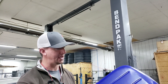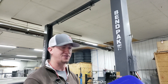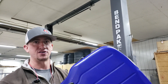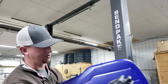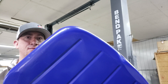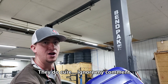This is the back of the vintage chair that we're restoring. When we put on the top coat we noticed there were some starbursts in the powder. What that means is you're having grounding issues and the charge is building up in certain areas and popping up through the powder. There's little dots, little circles, and when you do certain powders it's really hard to have them go away in the bake cycle — they don't flow out, they don't cure.